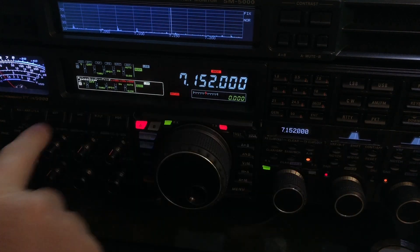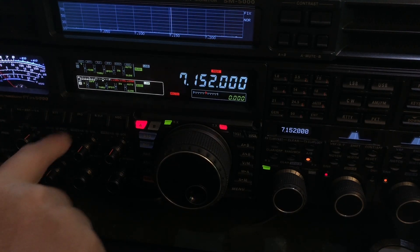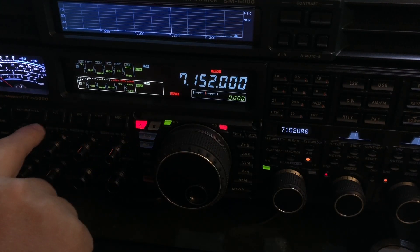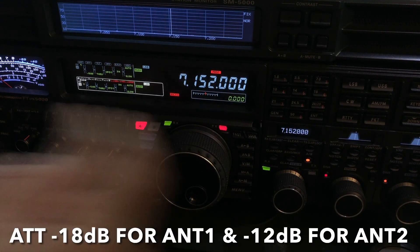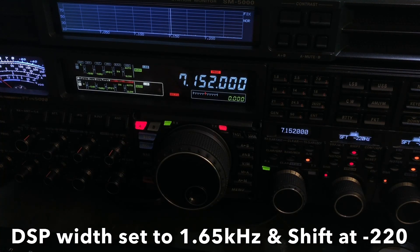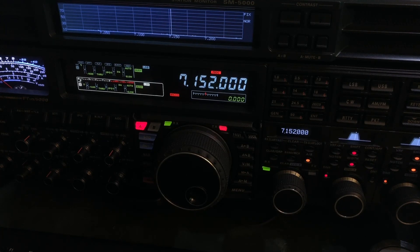It's just awful. First thing I'm going to do is attack it with gain. As long as I can hear those guys I don't need much front-end gain — let's try negative 12 on that one and negative 16 on the first. Then width at 1.65 and shift at negative 220. That's also helping with the noise we're getting from the jamming signals.